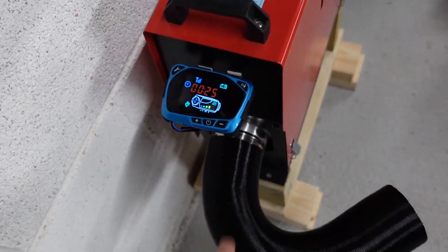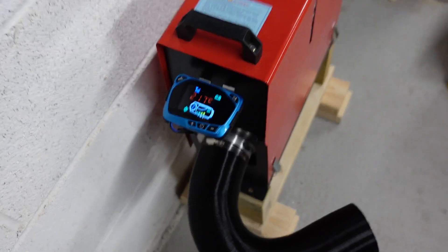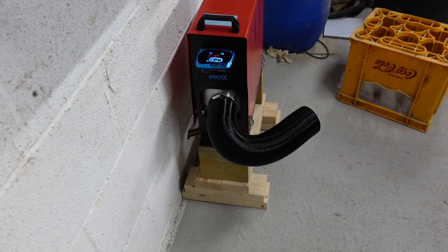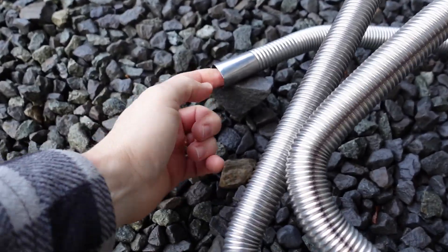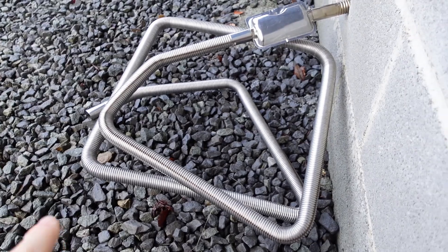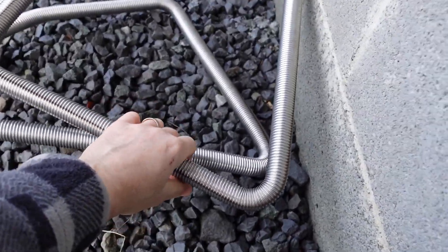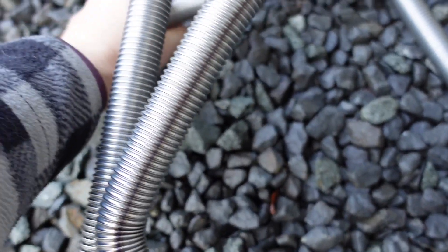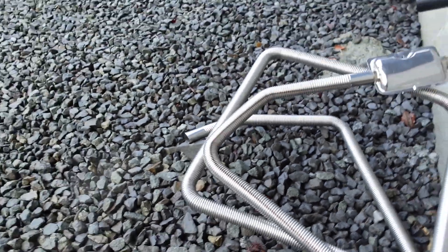It's been running for about 20 minutes now. Combustion chamber temperature is normal — that's good, it's ticking away on number five. Not a lot of condensation there. There is water in the end of this pipe, so condensation is definitely a consideration. I've taken some of the kinks out. That's hot — don't touch that. It's fairly warm further along. Yeah, there's heat there. I think there's heat to recover.